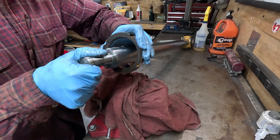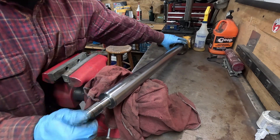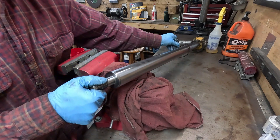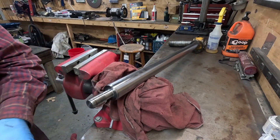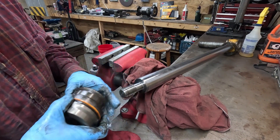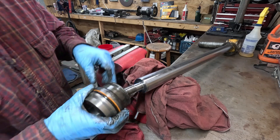You're going to want to look this rod over for any gouges or burrs that would cause the new seal to fail. We're going to go ahead and install our outer gland nut, our snap ring, and then our inner gland nut back onto the rod. Always put plenty of oil on all these parts before assembling them.